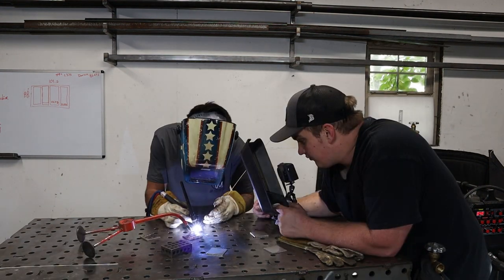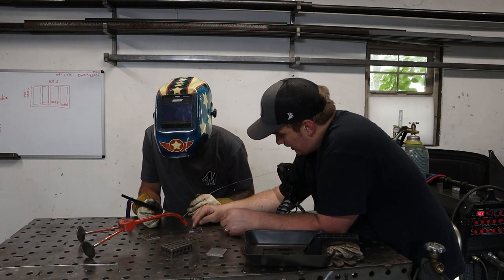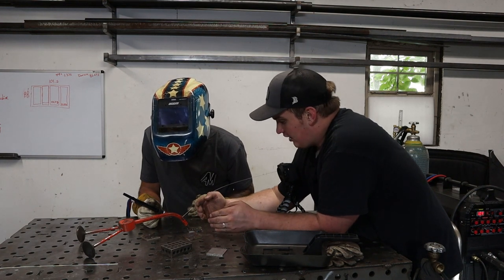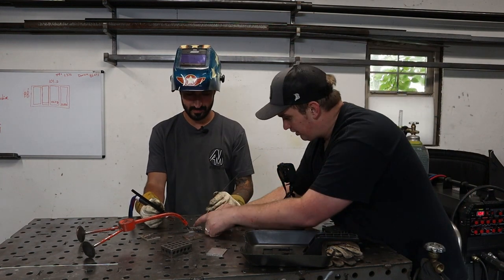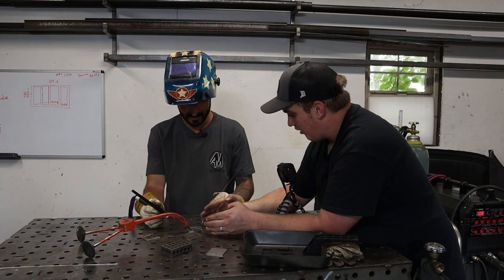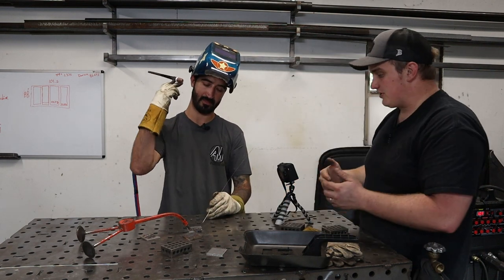Okay. So, did you see? I lost it. Yeah, exactly. So you got up to that spot and then you lost the rhythm on your dab. Yeah. And so that's where I was saying that sometimes you've got to hold up that travel speed enough and watch the sides of your puddle to make sure you're filling it out. So you might have to hold up just a little bit, shove that rod in there as fast as possible, and then you can proceed forward.